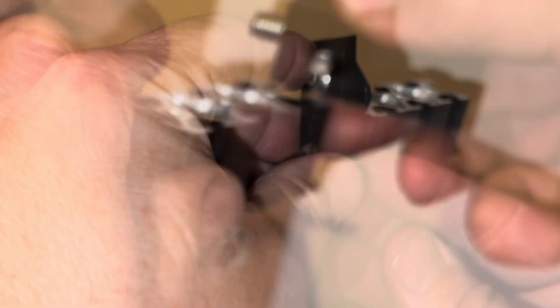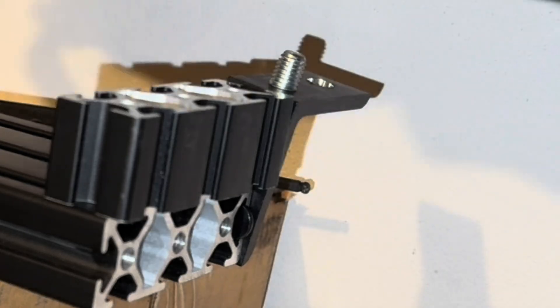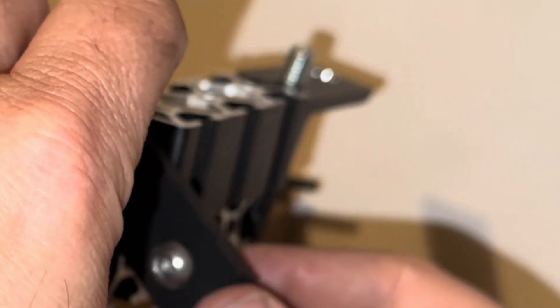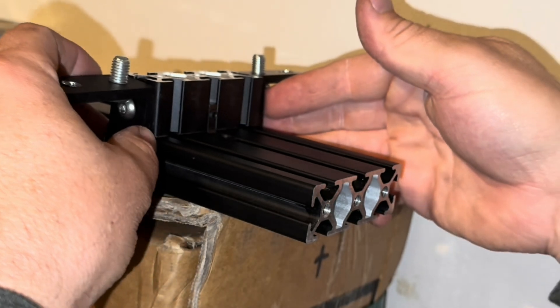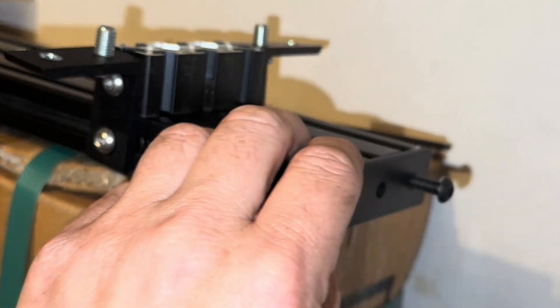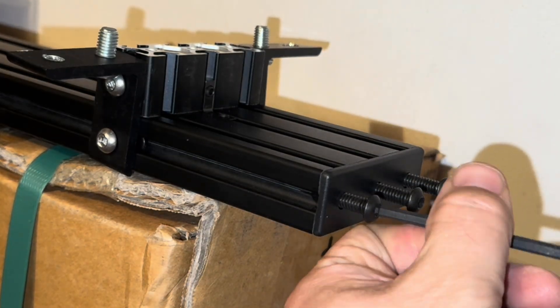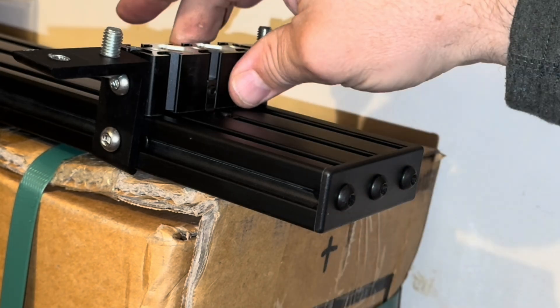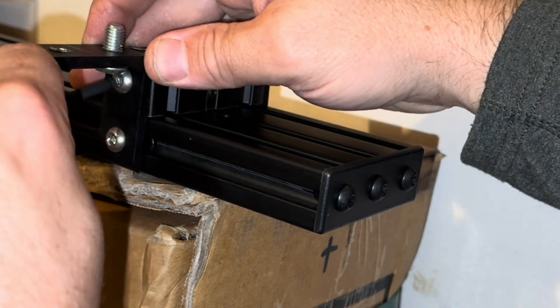Take one of the pre-assembled inside corner brackets. Take the T-nut by the corner and slide it into the side of the one inch bar, then take the other T-nut and slide it into the end of the long bar. Follow the same procedure on the other side. Next, take another hidden corner bracket and slide it into the center of the one inch and into the center of the long bar, then install the end cap. You'll notice that the one inch piece can slide up off of the brackets and T-nuts — to prevent it from falling out, just snug up one of the screws on the side.